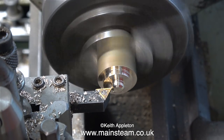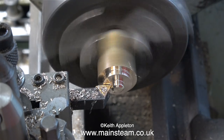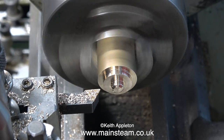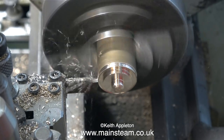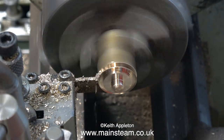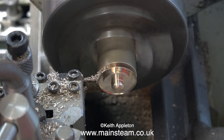What I'm doing at the moment is rounding the end — totally freehand, but it does the job. I've worked on Bassett-Lowke boilers before, and I have seen the original ones which are made from castings, but this one should look okay when it's finished. The time has come to part off the piece that I need. Once again in this episode, just to illustrate the point, I'm applying too much pressure, and the work keeps grabbing the cutting tool, but as it's brass it's not strong enough to rip it apart.